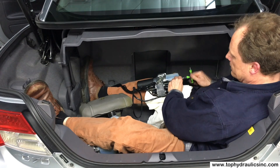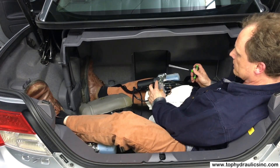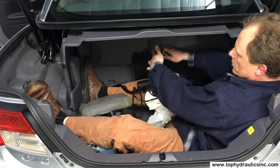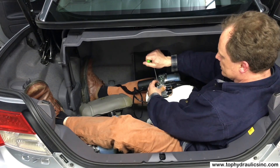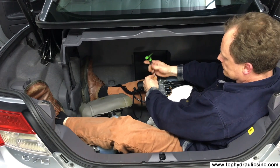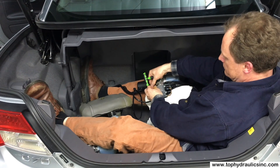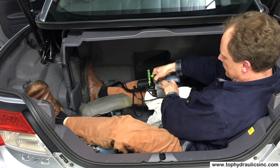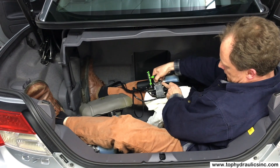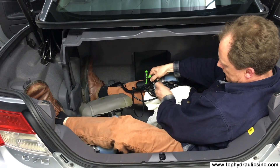The last thing is the safety and pressure release valve that you activate when you pull the cable under the rear bench. Just undo another T25 bolt here and walk this little brass ball out of the retainer. Pull it out, and to put it back in, push it back in here.